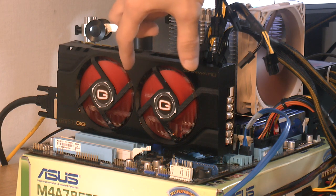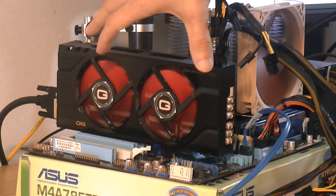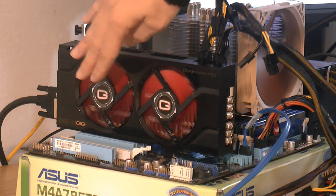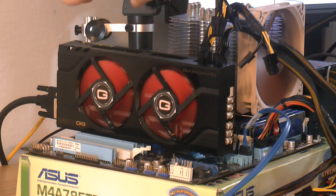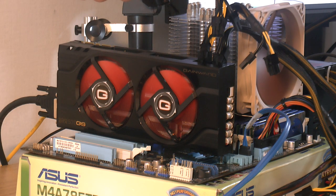Because the thing with axial fans like these is that they really don't go up in static pressure. If you increase the diameter and maintain the flow, they go down in RPM. They will lose static pressure. The only way to get it up again is to make them thicker. With radial fans, when I check data sheets, the static pressure seems to be exponential with the diameter, which means the bigger it is, the better. And EVGA has had a few cards with blowers, like the 680 Classified, I think, was about an inch wider and about an inch longer. And that would compete with the best open air coolers within a decibel and within a centigrade on the temperatures.